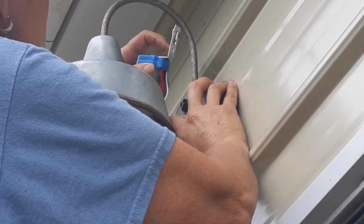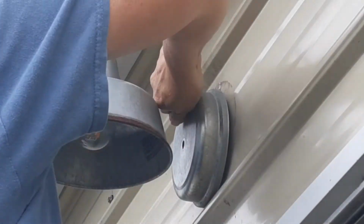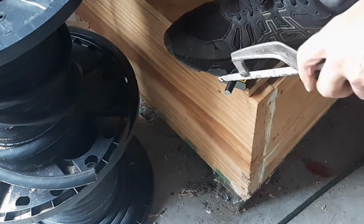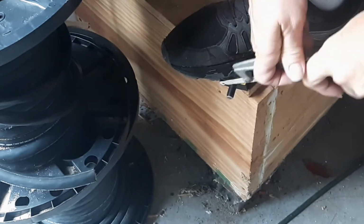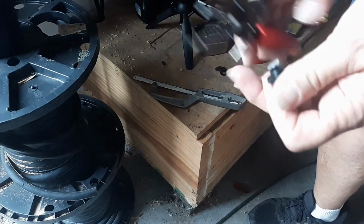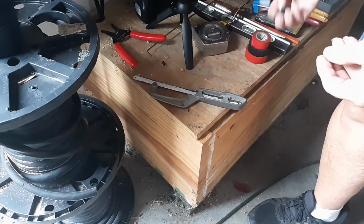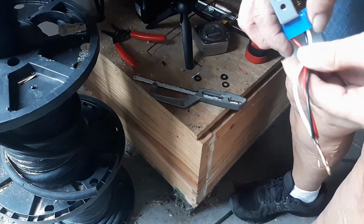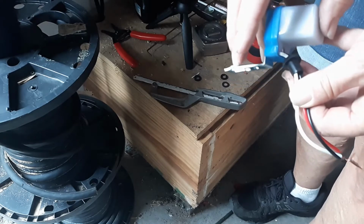I purchased this blue and white sensor here, and I am actually going to install that on this light. Now, since this sensor is a bunch of junk, don't waste your time. Cut the sensor eye off. It's hollow on the inside. You cut this glass off of there and you can use that as your grommet going through the metal on your light, keeping it from chafing or cutting the wires. So, perfect fit. It has double little plastic lock nuts with rubber gaskets, so the other sensors weren't a total waste of my money.